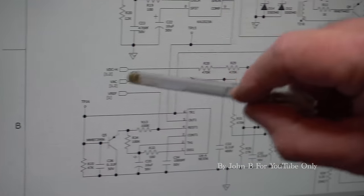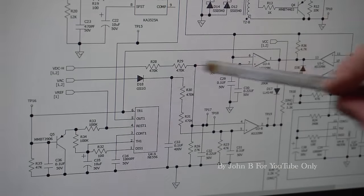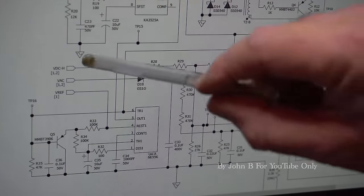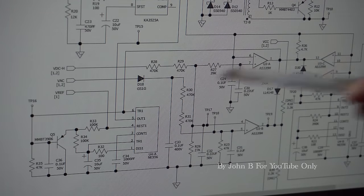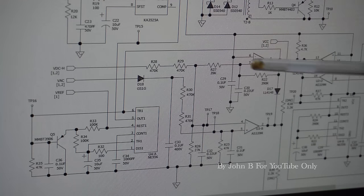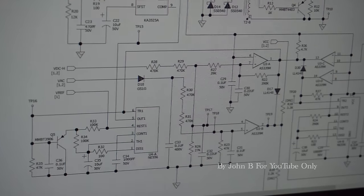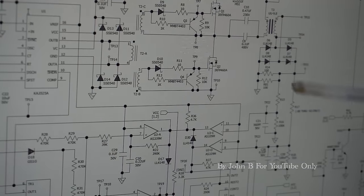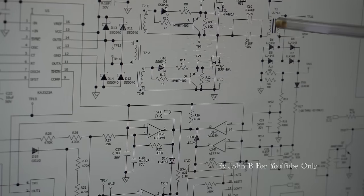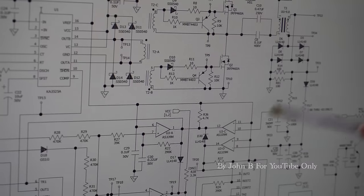So coming back down here, I imagine this first comparator is checking a mains under voltage threshold. So if it's too low, it will trip this and pull this down and knock on that limit. So that's probably a mains under voltage. Then there's two other comparators over here. Wire to a little, I think it's a current transformer. Here, you can see a bridge rectifier set up there. Very light load, because I probed one of these and the amp turns off for a second and back on.